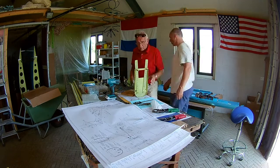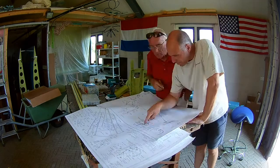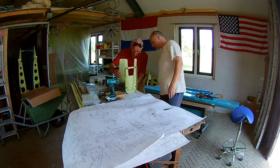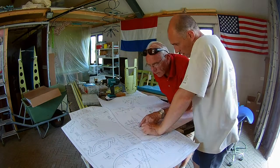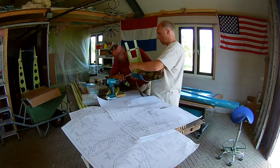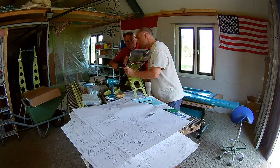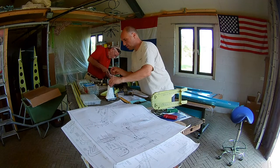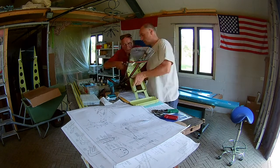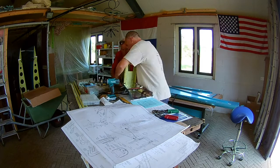Afraid of making mistakes, of course, because every mistake here is lethal, you could say — or at least will cost you money and time. There is a hole they call a mouse hole according to the plans, but it's not big enough in the 712 bulkhead; you have to enlarge the hole. Already getting closer — you can see the 711 is in there together with the tail wheel. You can actually remove the tail wheel part, which we do later, which is much faster. The whole tail wheel part is just too much hassle.